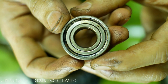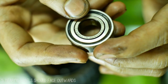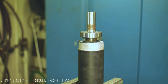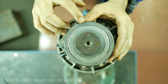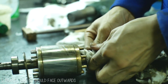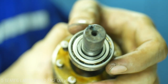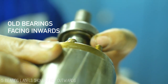Tip number 5: when installing the bearings, make sure the label specification faces outwards. As mentioned in tip number 2, when the motor nameplate is badly corroded or missing, you have no choice but to look inside the motor for bearing specifications. If the label is facing inwards, you have no choice but to remove the bearing and hope that you have the spare in your inventory. It may not matter to you, but it matters most to the future ETOs after you.